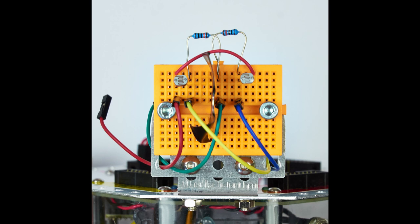Now that the power and the ground wires are connected we need to connect the two wires from the LDRs. These will be the blue and the yellow wires shown in the picture. First take the yellow wire and connect it to the left most LDR at the point where it joins to the 100k resistor. The yellow wire needs to go in the hole to the right of the red wire.